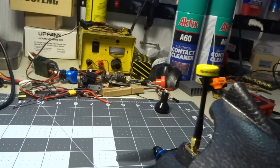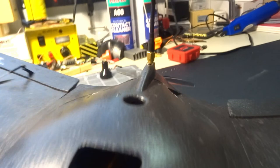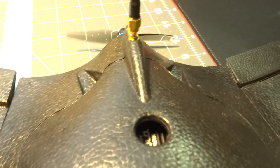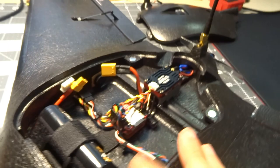With the hatch back on you can see how neatly that all blends in. If you look inside with some light, the video transmitter sits right in there — the air intake here will flow right over the top of and around that video transmitter, exiting through the two outlets in the back and also out of the little hole in the top, keeping the VTX nicely cooled.